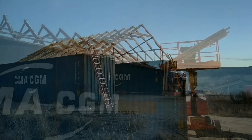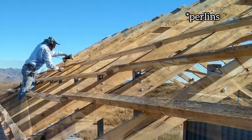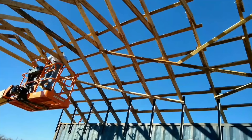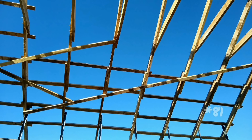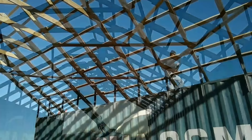The rafters are spaced roughly three feet apart. The purlins are made out of the same material, just cut in half — roughly two by three. The recommended spacing for the pro panel we used was two feet between purlins, so that's what we did, which ended up being nine runs per side, 18 runs total. I think it was 72 purlins that I had to cut — quite a bit — but that spacing worked out fantastic. As I was climbing around on the roof screwing in the screws, I felt it was firmly supported and not in danger of bending.